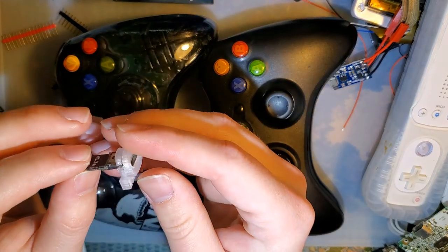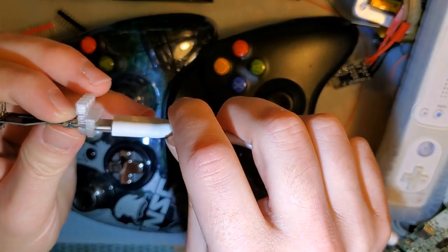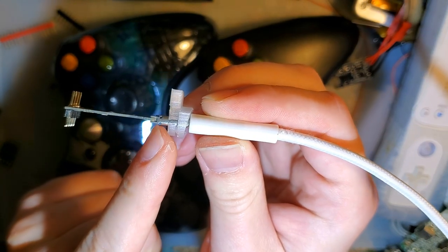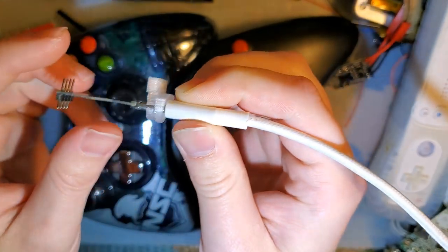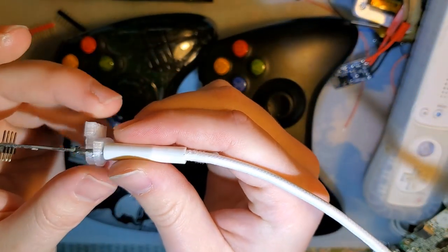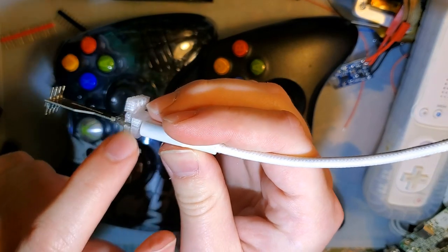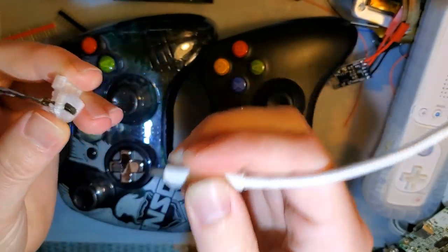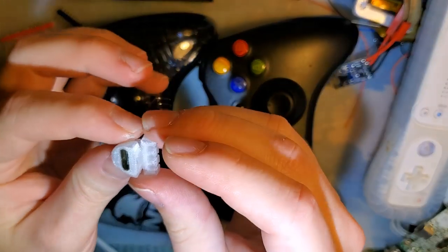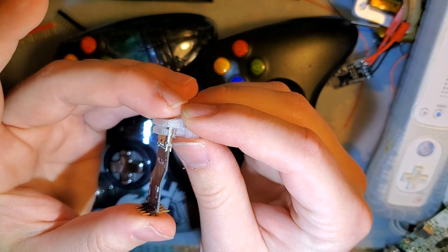And I think, as I might have started explaining in the video, the problem is the port itself. If you take a look here, you plug a cable in and you put any force on the cable whatsoever, it's torquing these solder joints right here, and either the joints break or the pads lift off the board, but either way, the result is your mod stops working. Now, a solid plastic bezel can help significantly with that, as opposed to printing in a softer plastic like TPU, but the problem is with how big the port is and how much space we have, there's really not a whole lot of other options.